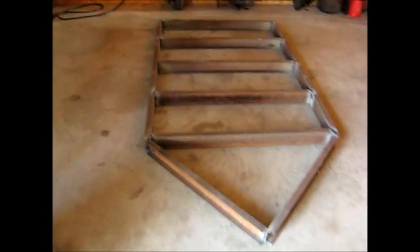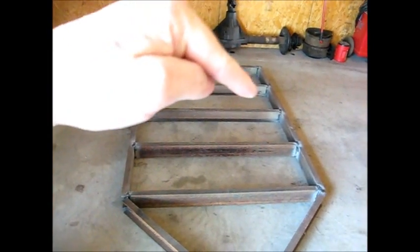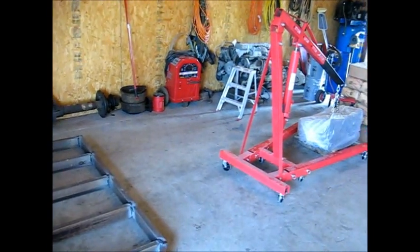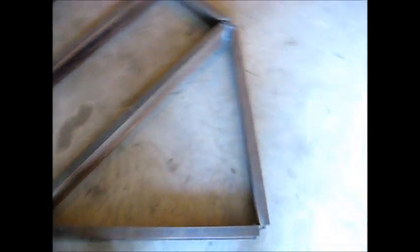I've been building a little trailer. I'm going to add about a foot on this tongue, but the bed is six foot by four foot three. I just wanted a little trailer heavy enough for hauling these Cummins and stuff around — something low enough to where I don't have to put it up in the bed of a truck. I'm going to come in here with a piece of pipe, cut a hole through the front of it, and the hitch will come out to about right here. Then I'll put a bulldog hitch on it.